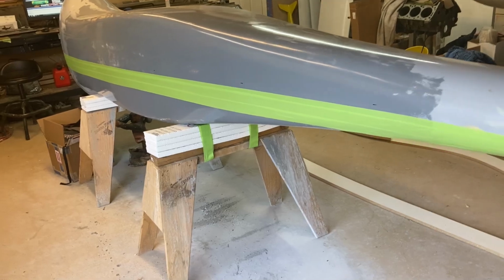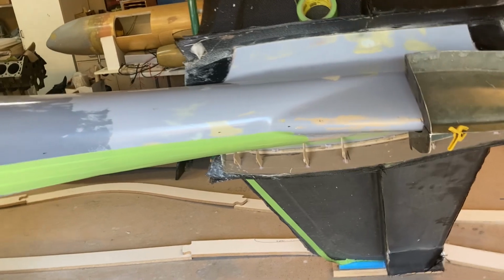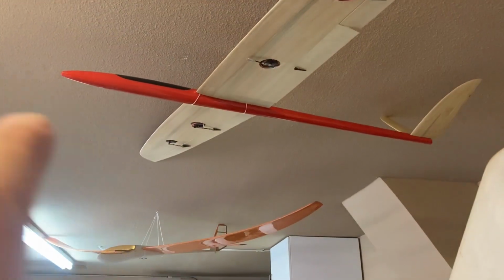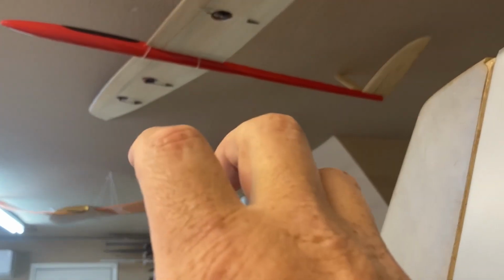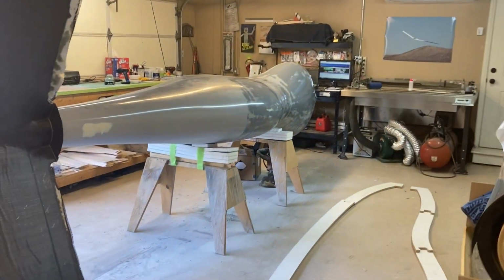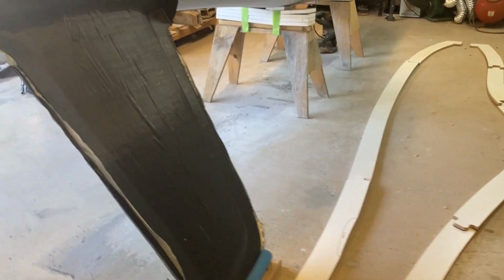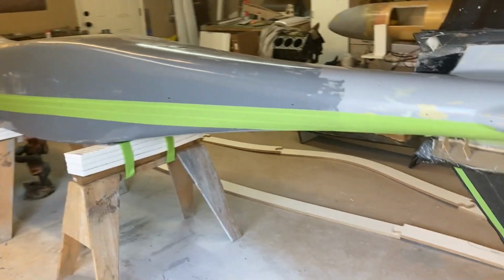But in the end, it just makes it a little bit easier to do a large piece like this. Typically with model airplanes, you'll have a splitter plate that goes essentially all the way around in one piece, and you can kind of cut it and fit it, and then you push the fuselage plug in place into the Bondo, and it kind of finds its own level. Not really practical here. It's just far too large, so I do it in several pieces. So I'm going to get going on that, and I'll show you the progress as we go.